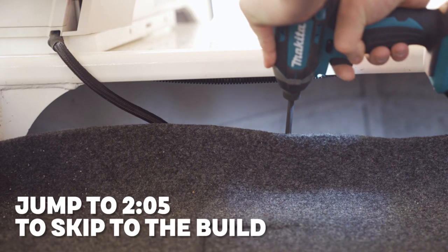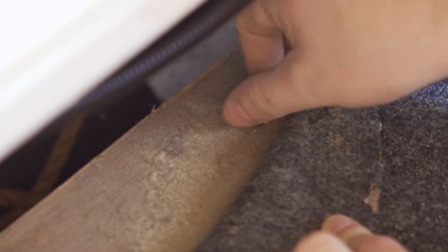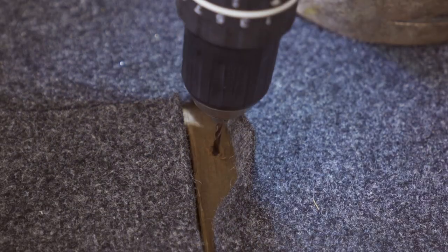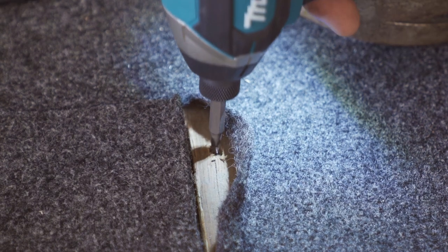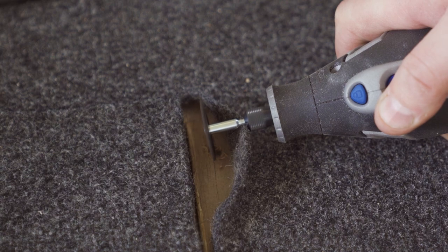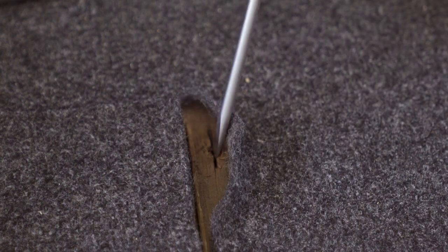Back to present day, the deck doesn't look too different to what it did a year and a bit ago. Credit where credit is due, the deck is done well considering it's pretty garbage. The deconstruction of this homemade monstrosity was nothing but nightmarish though. Not only were the screws hidden underneath the carpet but they were rusted beyond all recognition. If this isn't evident enough to use quality stainless steel on your builds, I'm not sure how else to illustrate it.